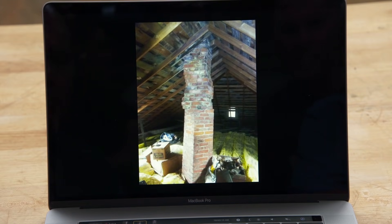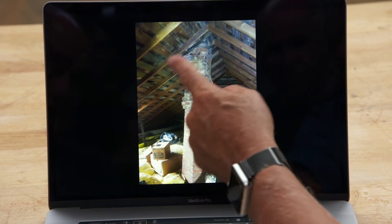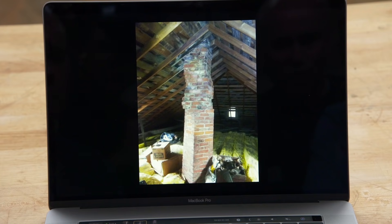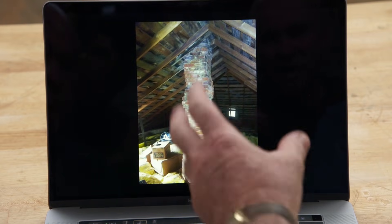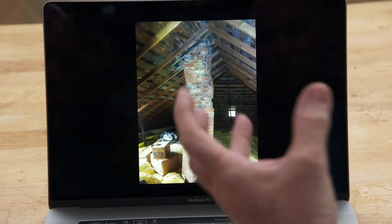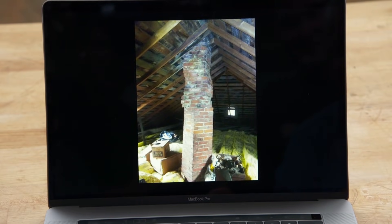But look at this — Nancy from Indiana. Oh, Nancy. Now that's an old house, all right. Look at the skip sheeting on the roof — one time that had a wood shingled roof, and you can see how bad it was leaking, a lot of water damage. Notice the chimney's diagonal — there's probably a coal stove right below it in a parlor or dining room stuck in the corner. It came up at an angle, didn't know really what to do to get out of the house safely and watertight — that's probably why you have all that damage. They brought it down to something solid but didn't know what they were doing going back up. And I think you guys are missing the most important part — a case of beer. That explains it.